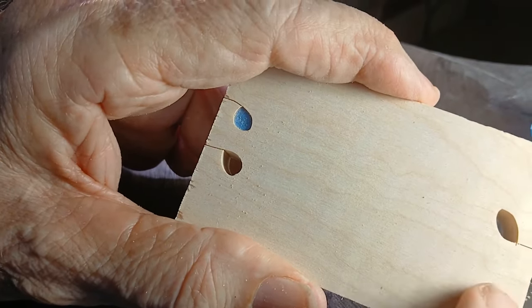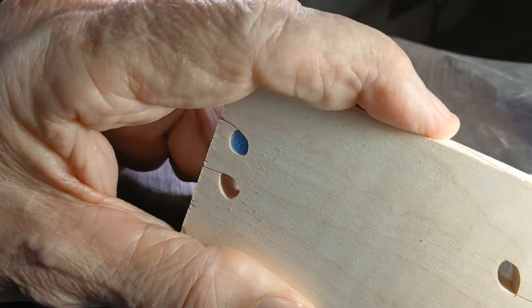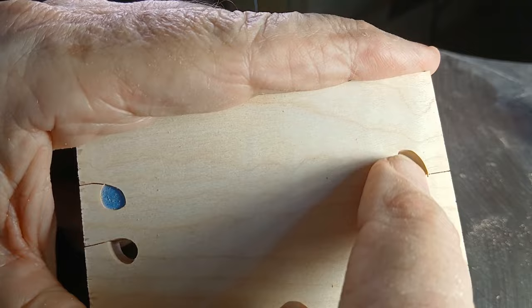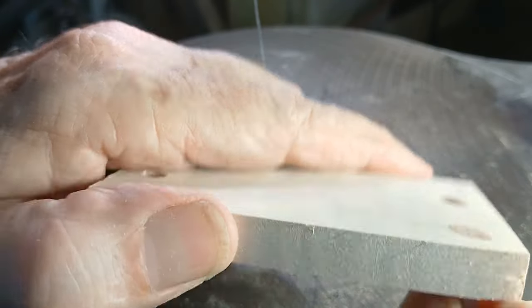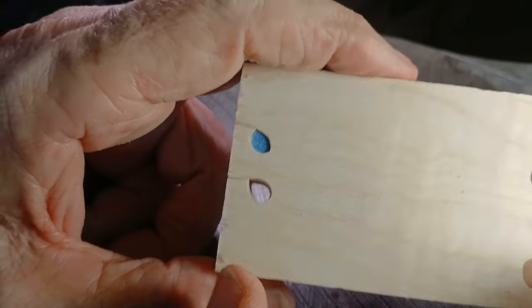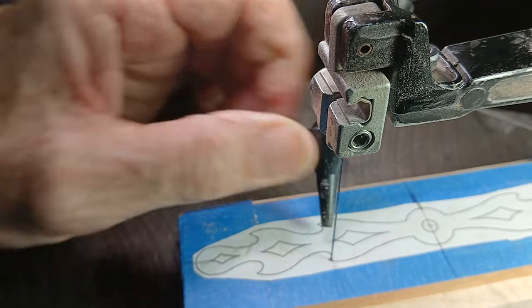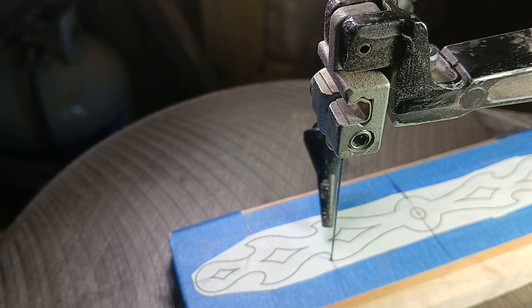After a fourth cut, I've gone to two and a quarter. Two and a half was still sticking up a little higher than I liked, but two and a quarter is just barely anything sticking up — I think that's going to work perfectly when I sand it. So I'm going to leave the table set where it is, set up my piece to cut that outline in my lid — what's going to be the top of the box. I've got it pretty well centered, drew some lines to get it as close to symmetrical as I could. If I mess this up I may ruin the whole project, but we'll find out.